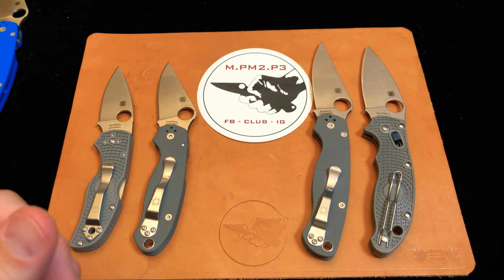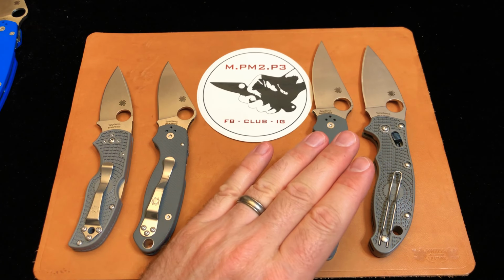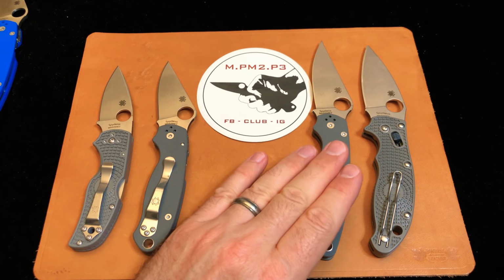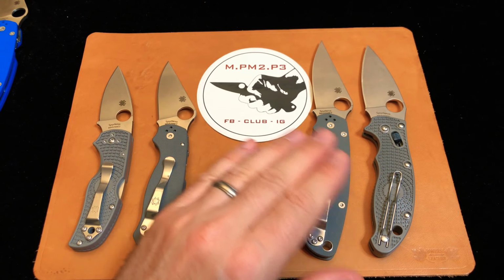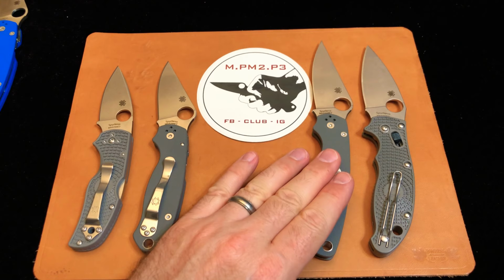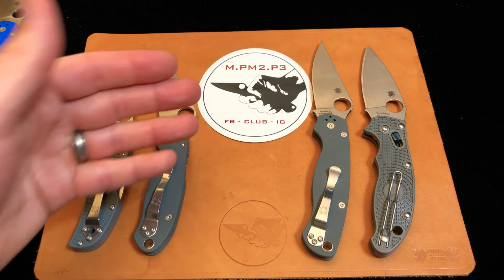I've found personally that when I sharpen Maxamet, it stays sharper and is more enjoyable to cut with if I leave the edge toothy. So I generally don't go very, very fine on my sanding to give it a mirrored edge. I prefer the toothier, more aggressive edge on the knife. I just find that it cuts better.